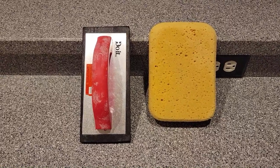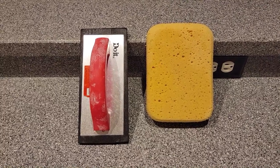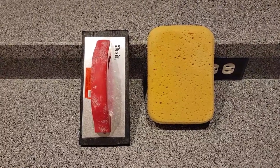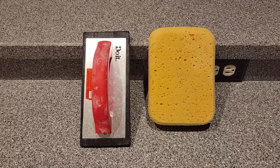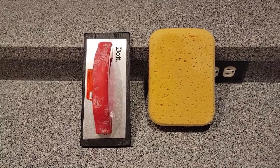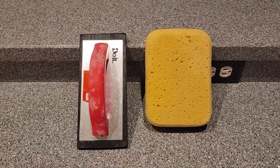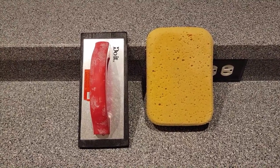In the footage to come I'm going to show you how I prepared the grout — just like the thin set, you add water to the bucket, then add the mix and use a drill to mix it to a consistency of peanut butter. Next I'm going to apply the grout and then use the sponge to clean the tile.